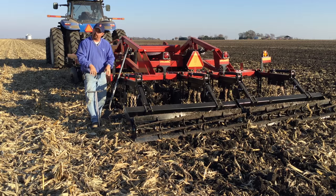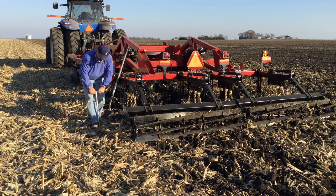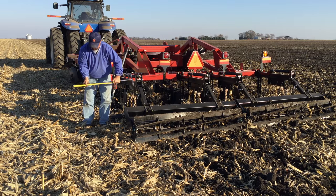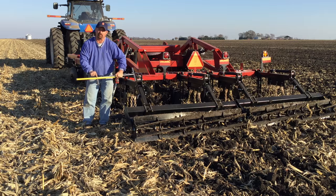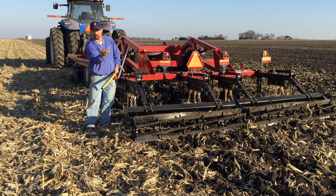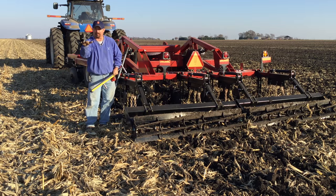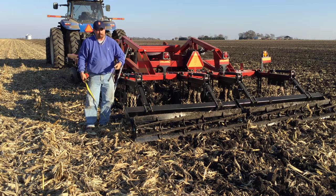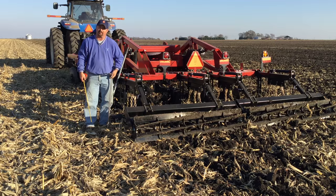I can get about 14 inches in soil depth with this soil probe. If the soil density layer is a little deeper than that, you'd need a tile probe for extra length. I'm starting to feel a soil density layer right about here. I can pull the probe up — I'm measuring about a 12-inch soil density layer where I need to get underneath to lift and fracture. If I can do that, corn or soybean roots won't hit that layer and grow horizontally. We need to bust through that soil density layer. This is an easy way — do this numerous times in the field and measure where that layer is.